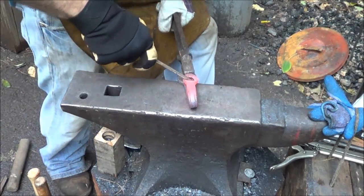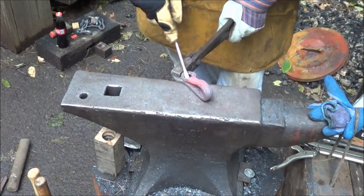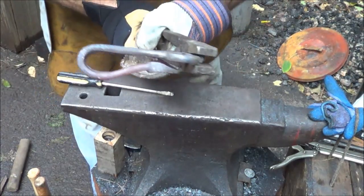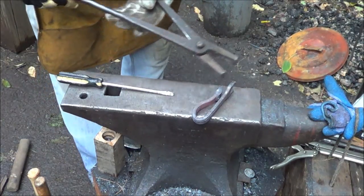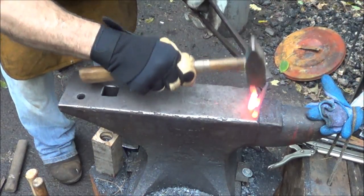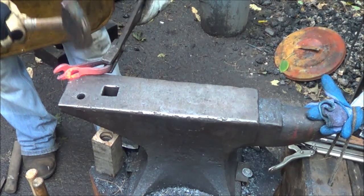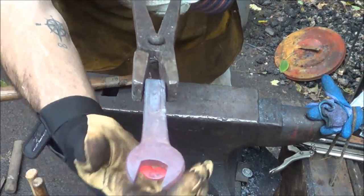Back to the pry bar — put a twist on it like that first. There we go. Now we need to move it over and up. Perfect. So now we're looking pretty good. Looks nice. I'm going to go ahead and kind of flatten the sides on that box a little bit and then roll that tip down. I just want to put a bit of an organic shape to it — nothing too much. It just kind of flows into the width of the bar a little better.